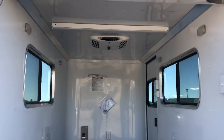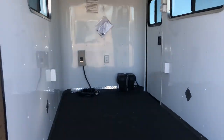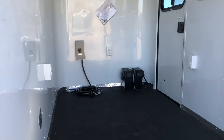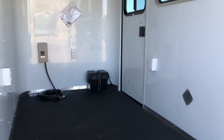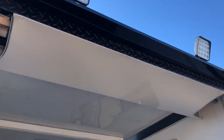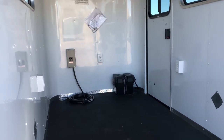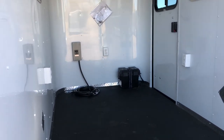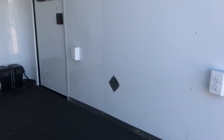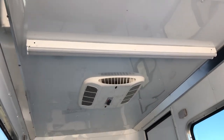Overhead four-foot LED light right there, as well as an AC unit with a heat strip. Coming in closer to the trailer, you can see there's a 30-amp plug right there with your box, and next to that is a battery with a battery box — that's going to run all your puck lights as well as all your spots, so you can have interior and exterior lighting without being plugged into anything. Your 30-amp service makes your interior outlets work — you've got four of them in here plus the exterior GFI — and it'll also make your AC unit and four-foot LED work.